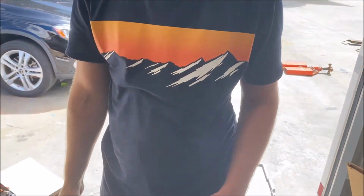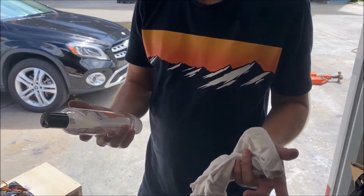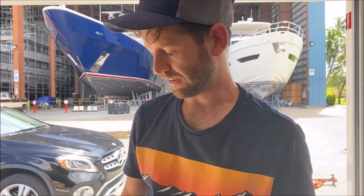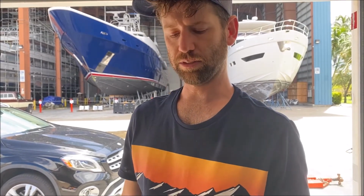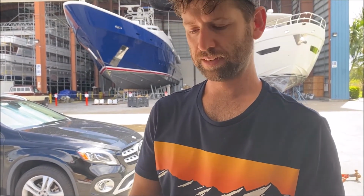Howard cutting board oil. I'm going to use this on the inside of the box. The reason for that is we're going to work with food, raw meat, so you want to keep it as hygienic as possible. There's going to be blood and sauces dripping on the wood, so we just want to protect that, and it's easy to clean afterwards so the blood won't draw into the wood.